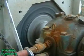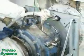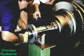The rotating equipment is then stopped and a trial mass is added. This trial mass allows the amount of unbalance to be identified and a calculation made to determine the mass of the balance weight and its location required to cancel out the unbalance.